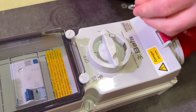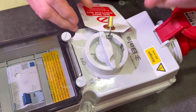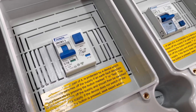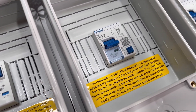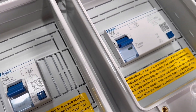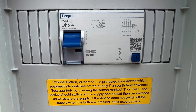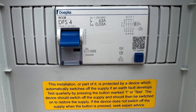Of course you can always lock the isolator in the off position for safe isolation. You've got to work really hard these days to avoid fitting RCDs to socket outlets, but including them as part of the socket outlet is an easy way to comply. These C-Norm sockets support this across the range, including the 63 amp one we've installed here. I'll put a link in the description for the full range where you'll see all the different options.